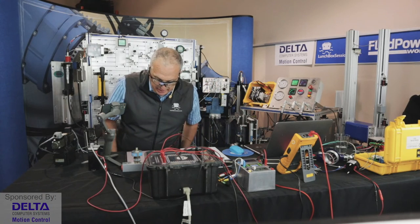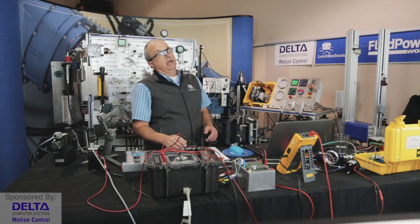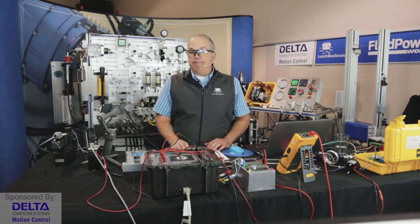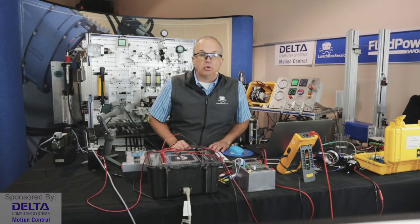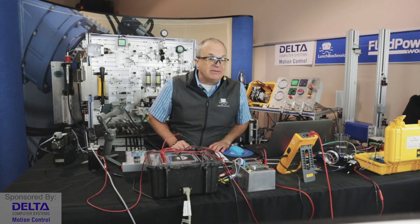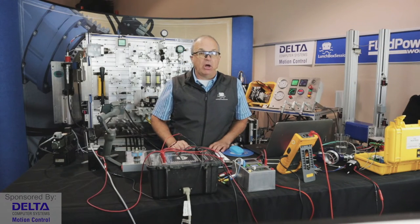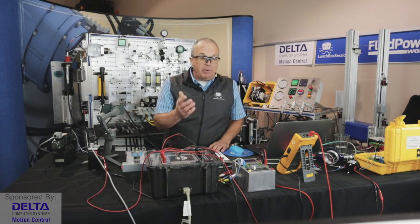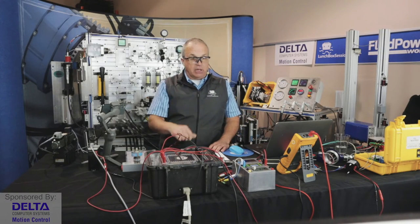Arnab is asking, sir, what's the difference between a PLC and an ECM? Good question. A programmable logic controller quite often lives in a control cabinet more in a plant environment, although I do see them on mobile equipment, very complex mobile equipment. Mobile batch plants would be an example, or on a mining shovel, sometimes still a PLC.